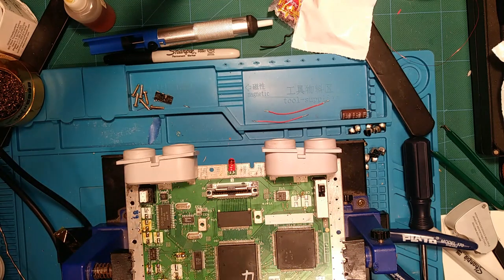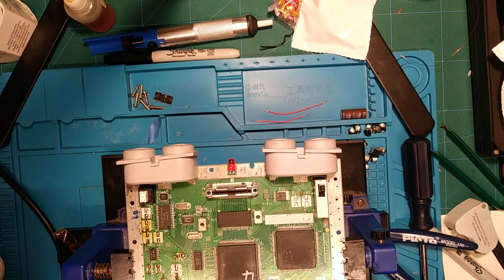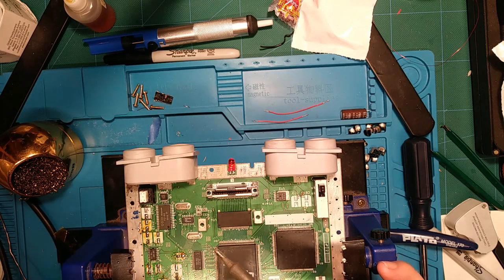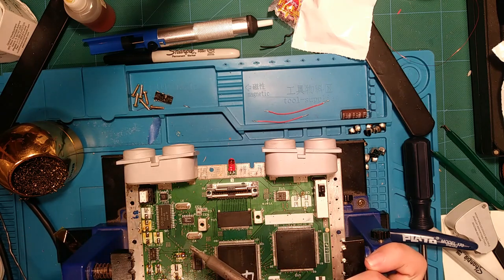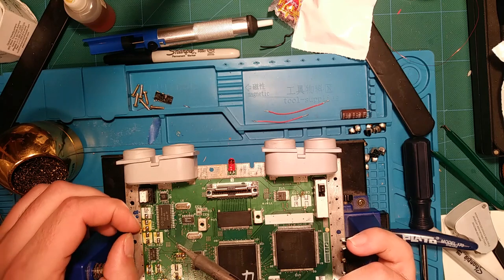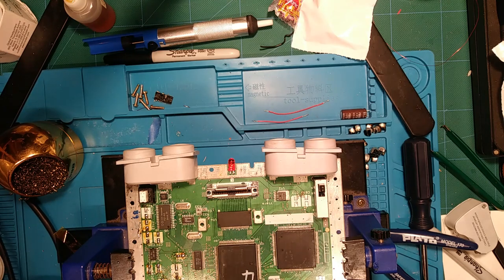All right, that does that. Yeah, I'll definitely show a little bit of the struggle there. Once you've got the technique down with those tweezers, they really are the bee's knees for desoldering stuff. There are just certain areas with that particular design where you can't get too close to plastic components, or sometimes you'll be making contact with a chip or something you don't want to. But for most things, most capacitors, most places, it's a great tool.